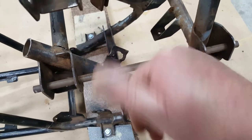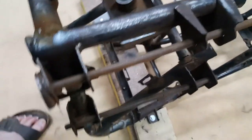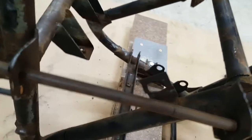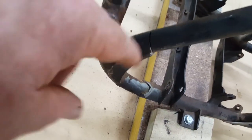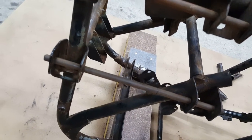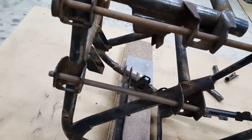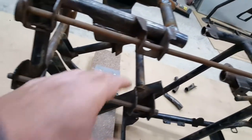I put the saw cut on the side it needed to bend towards, so that cut will close up once it moves. Similar arrangement on the other side — a saw cut here from the bottom, the other side from the top, and a saw cut through here from this side, because the thing had to come this way. And that's how those cuts would close up — and it did move across quite easily after all the frustration of it springing back. I was getting 20 millimetres of movement with a big lever but it always sprang back to zero. With those four cuts in, I was able to bring this section across the 10 millimetres.